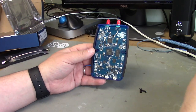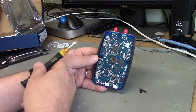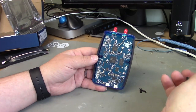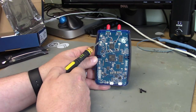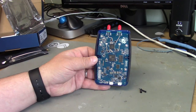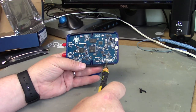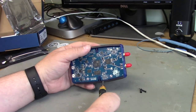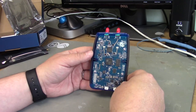And there we go — what's on board. This is the AD9363 chip from Analog Devices which does all the RF processing, and this is a Xilinx Zynq FPGA. There's some DDR RAM, some power supply components, and we can see a second UFL connector for transmit and receive, plus a clock-in and a clock-out connector. It's a pretty flexible board — there are a number of headers, and I believe you can break out some GPIO lines. It's brilliant that Analog Devices have brought these lines out to headers so we can hack around with them.